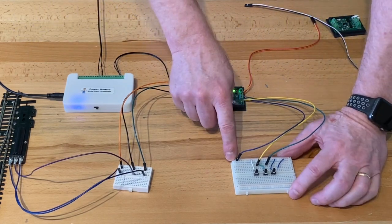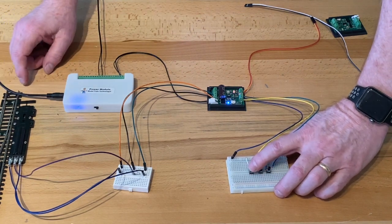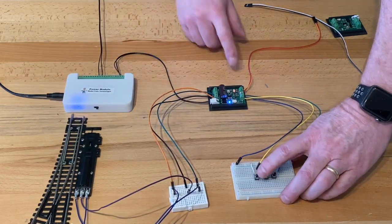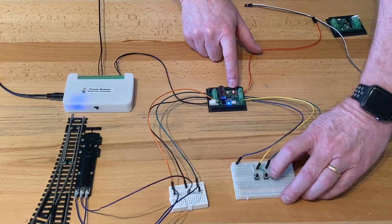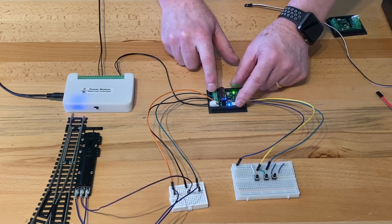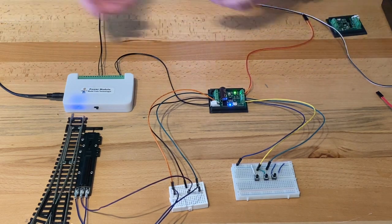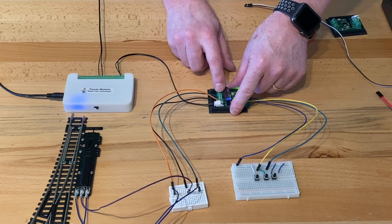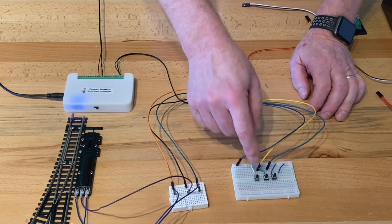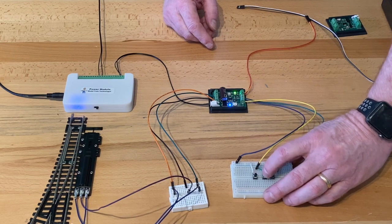I have a common and some push buttons. If I push the button, you can see the switch — I'm using two-switch mode, and you can see the turnout moving rather nicely. You also see the red and green lights alternating. When that's alternating red and green, the signal output — which will go to the dwarf controller, block signal, or relay — you just hook up the yellow wire and you're all set. Right now I have three switches; I'm just using the first two for left and right, or thrown and closed.